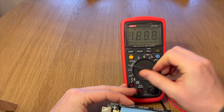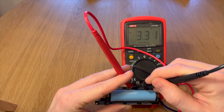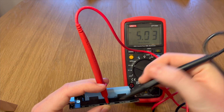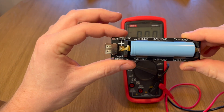At first I was not able to read any values from the output pins on the battery shield. But then I realized you had to plug it into a charger at least once in order for it to start working properly. The slide switch on the battery shield turns the USB port on and off. I decided to remove the USB port as well as the slide switch in order to save some space in the controller.